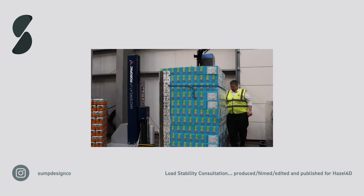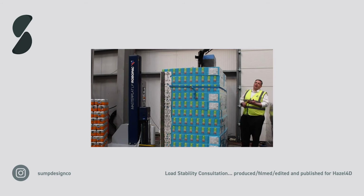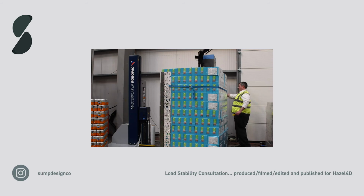Good, so we're using the Extremis 15 film still. What we're doing now is putting some additional revolutions around the bottom of the pallet to get the stability, and we're going to bring the film up the pallet slightly slower to get more overlap. I still believe that by doing so we're saving lots of money by preventing damages and returns in transit. So let's try it.